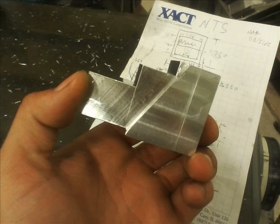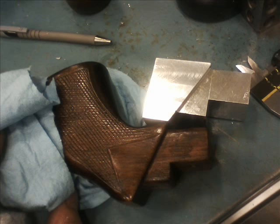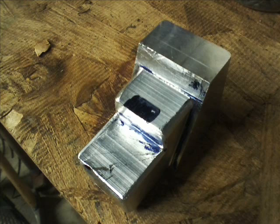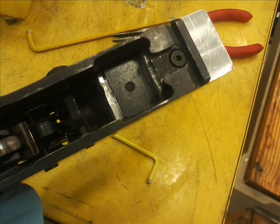I had to shorten the lower step a little bit in length because the bolt was interacting with it. I'm cutting the angle which is 27 degrees — the receiver is 63 degrees. I'm putting a radius on it so it'll fit inside the receiver, since the inside of the receiver is radiused. I'm cutting out the tang slot and a rivet hole here, but that rivet hole is unnecessary. Just a little bit of hand fitting with a black Sharpie, and there it fits.